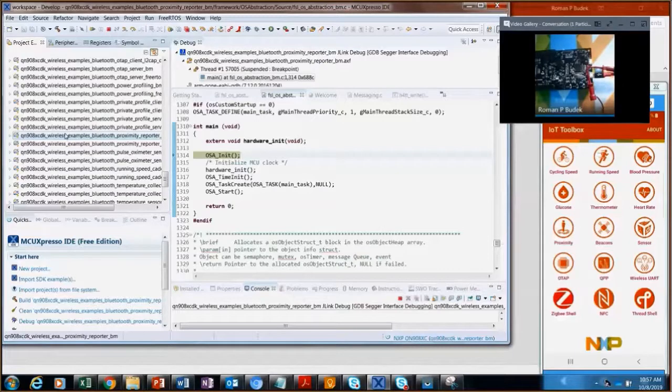to the USB connector. Normally you'd probably use a 2-position jumper and put it on, but in this case, to show for the video, I'm going to use an alligator clip, which makes it easier to show visually how it's plugged on and off. So you connect the DFU jumper, and then you go ahead and plug in the USB connector. When you plug it in, I can see that it's running some kind of app. It's blinking the LED. The easy way that I find is to run LPC script software.